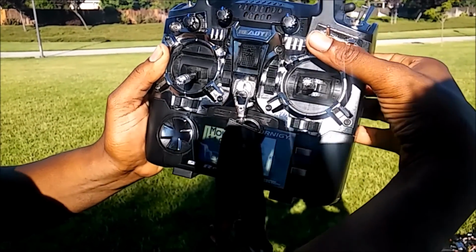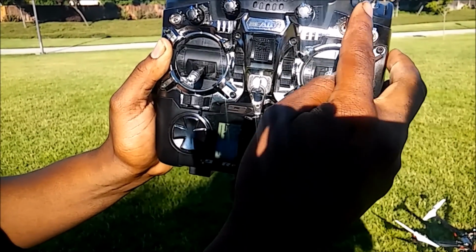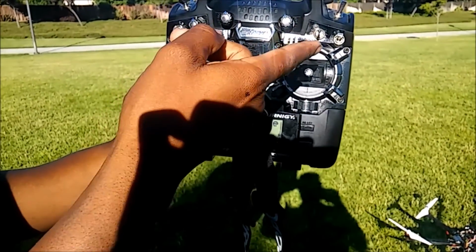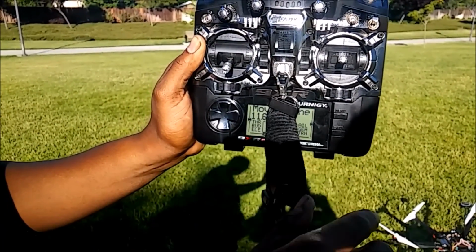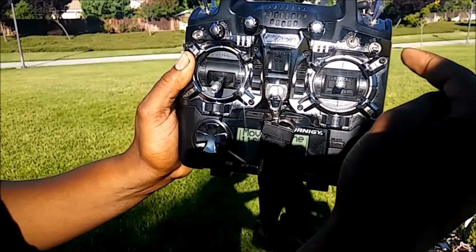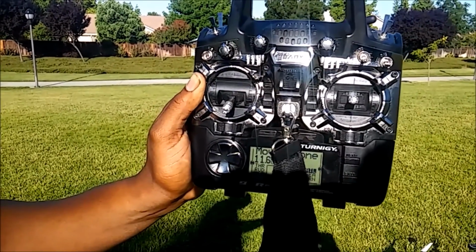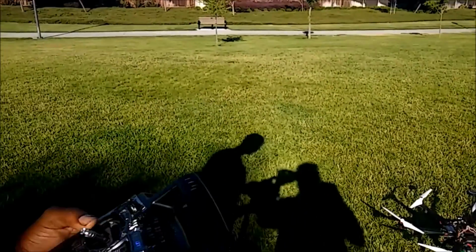So with both switches in the upright position, mode stabilize. Once again, the left switch in the middle position, mode loiter. If you can get a good loiter, then you know that your GPS and compass are functioning correctly. Left switch in the down position, that's auto mode. We go back to stabilize. Now if I flick the switch on the right, mode altitude hold, then mode guided, and mode return to launch. All right, let's go back to mode stabilize. Okay, so now we're in stabilize.